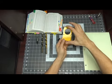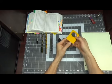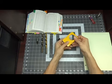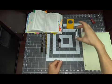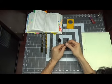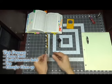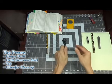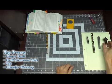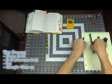So this plate has 4 holes and 2 blind holes here to mount to the basic structure. Now, the way that you usually start and make threads, you start with a center drill, you move on to a drill, then you move on to a tap, and you finish it off with a chamfer. Move that to the side.